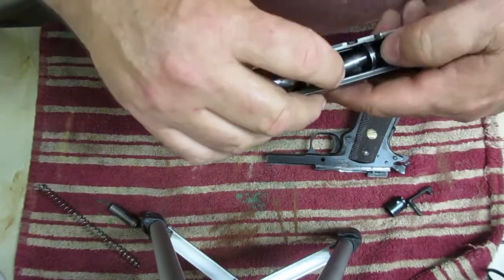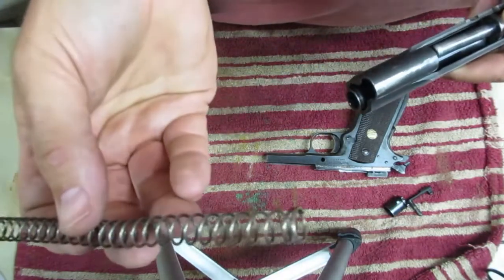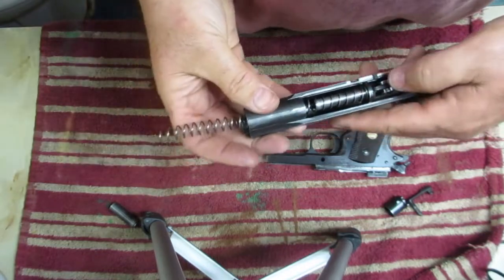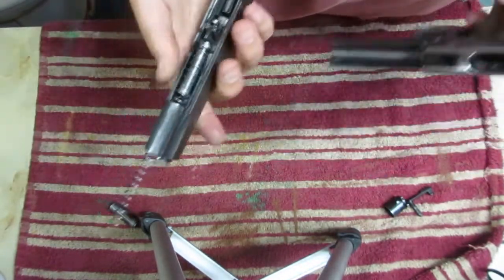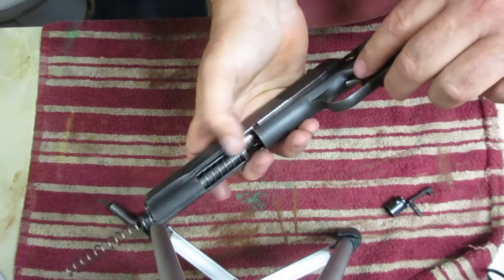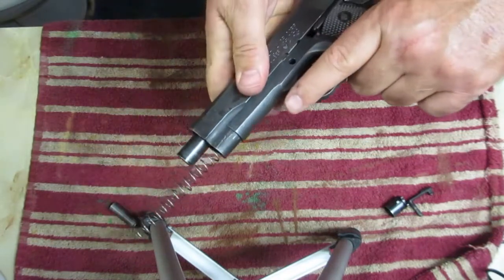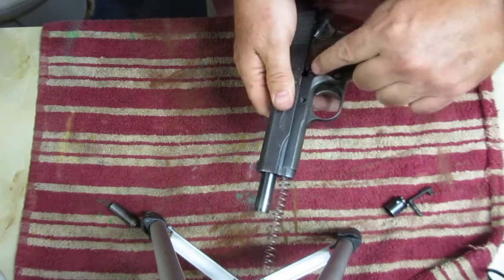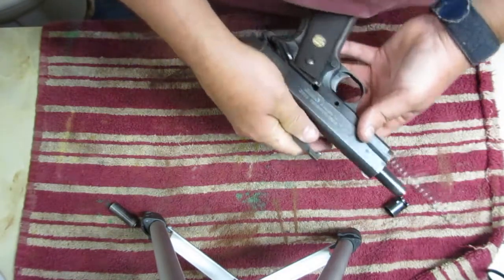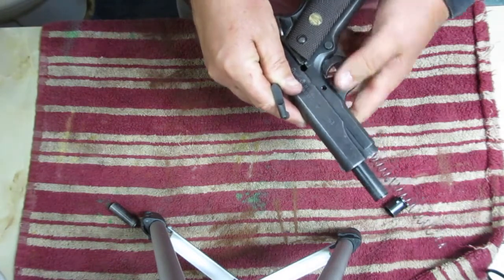Recoil spring guide — this little curved section is where the barrel lays in it. What I do is put my recoil spring in. It goes in on this model pistol — the recoil spring only goes in one way, and that's it right there. Excuse me because my hands are trembling. Slide that forward, and you want that notch lining back up with this, because you want the barrel lug to line up. My barrel lug is trying to be a pain in the butt, but there we go.